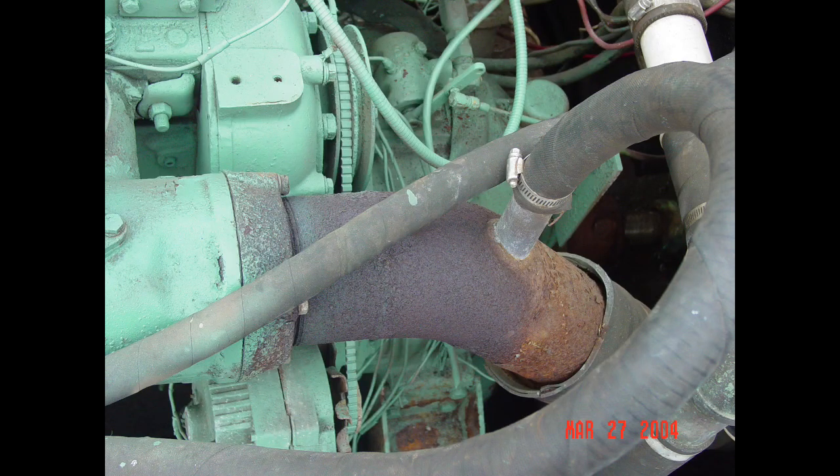What we have here is not a failure to communicate — it's your basic fire hazard. Cooling water is injected into the aft section of this exhaust riser where the hose is. However, between that point and the engine is a section of dry exhaust that gets extremely hot. This section of the riser should be lagged or wrapped with a suitable insulating material to prevent burns and protect equipment, such as the hose that's resting on it, from damage. Look closely and you'll also see that there are no stainless steel clamps holding the exhaust hose on the riser.